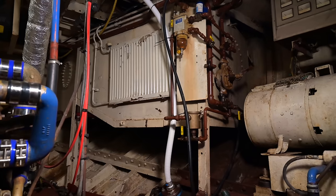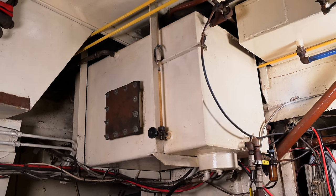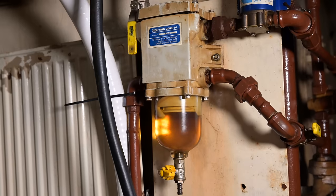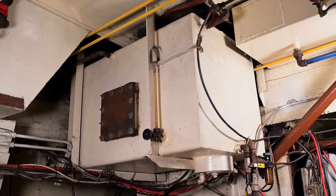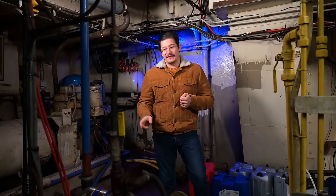And from the storage tanks, the fuel is transferred to a day tank. The day tank has about, as the name says, 20 to 24 hours of fuel in it. The fuel is gravity fed to the engine. We transfer the fuel from the storage tanks to the day tanks through a filter and water separator, so in theory, that should be just clean fuel in the day tank. From the day tank, the fuel is gravity fed to the first filter and water separator, from that first filter it is fed to a second filter at the engine, and from that filter through the engine, generating propulsion, generating noise and smoke, because it is a DAF.